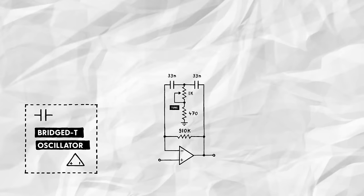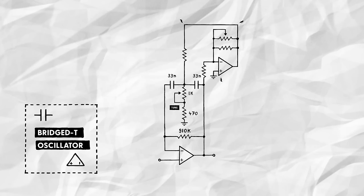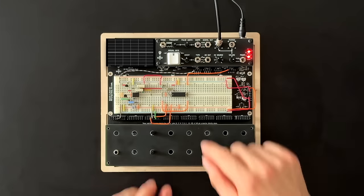For that, we'll borrow another idea from my kick drum video, forcing the oscillation to keep going for longer by applying positive feedback to the system. And we do that with an op amp set up as an inverting amplifier with variable gain. By using a 100k potentiometer in parallel with the 47k feedback resistor, we can dial in any amount of gain between 0 and about 0.6, which should give us a decently long tail on the drum sound.